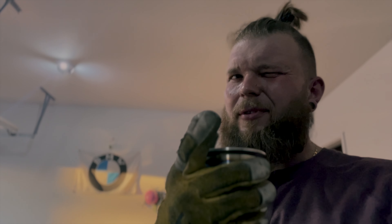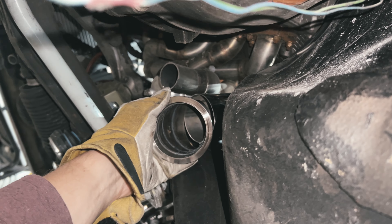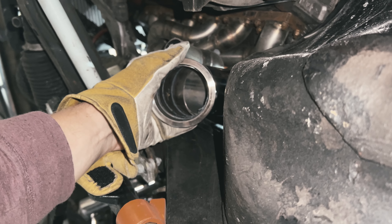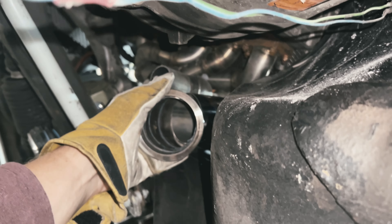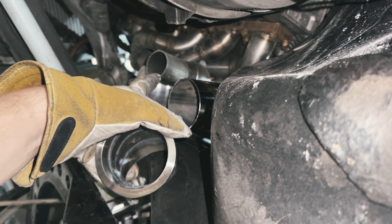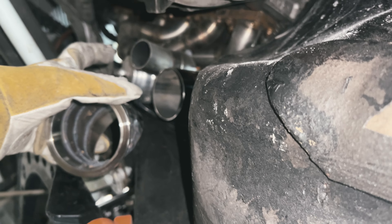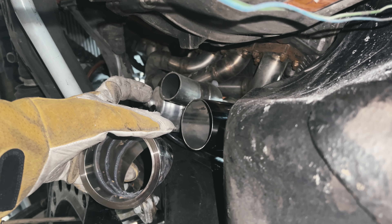Going to go underneath now, mark this piece, take the downpipe off, weld it — downpipe then is 100% complete except for the wideband O2 sensor bungs. This section is gonna be going here, just need to mark it. And you can see the wastegate tube right here — that's gonna be coming out a little bit further and attaching with a v-band right there to the exhaust.